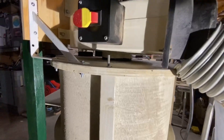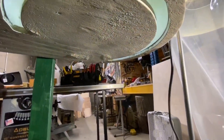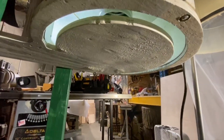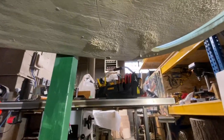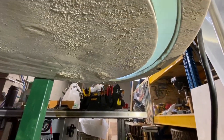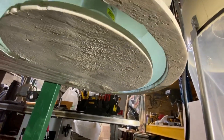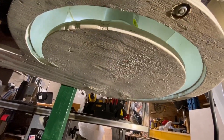If we can get down underneath the baffle, you can see there's this slot cut all the way around, and the inlet is up here. The dust starts on that side of the baffle and is pushed around by the tornadic action inside the chamber, then drops out the bottom into that big trash can.